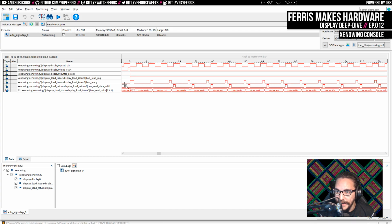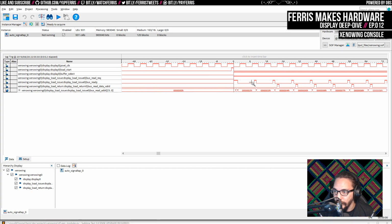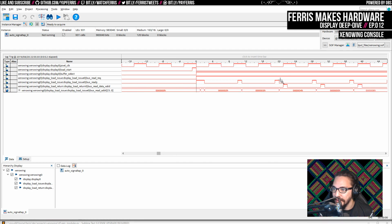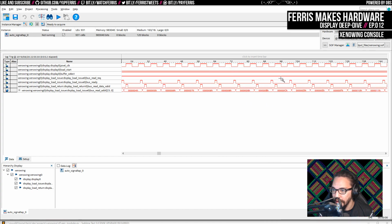We issue, this is a read request, so it's requesting reads all the time. And it looks like it gets in 2 read requests here, and then we get the data back here, but we can issue more reads within that time. So here we can still see it's 1, 2, 3, 4, 5, 6, 7, 8, 9, 10, 11, 12, 13, 14, 15, 16, 17, 18, 19, 20, 21 cycles latency there. But you can see, because we're able to at least pipeline these issues, that the data comes back fairly regularly after that. So we're able to pipeline a lot of these.